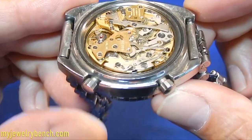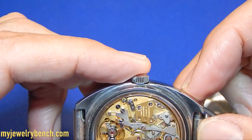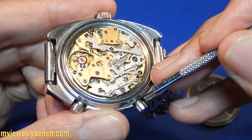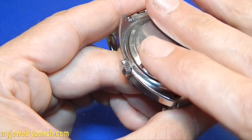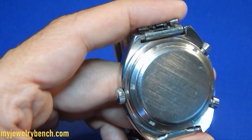Originally the buttons had heavy seals so they were watertight, as was the crown. With wear on the original crown, the customer doesn't want to replace it with a generic crown — which I don't blame them — but there's just no way to completely make this case watertight. We can replace the gasket on the case back and the gaskets on the buttons, but without major modifications to the crown we're never going to water-seal this watch. Just keep that in mind with an Octavia if you find one. It has a beautiful, well-made screw-down back — if you can screw it down with your fingers and hear no grinding, that's a good case back, and this one was manufactured very well.